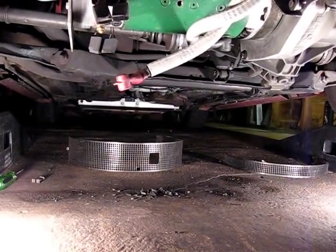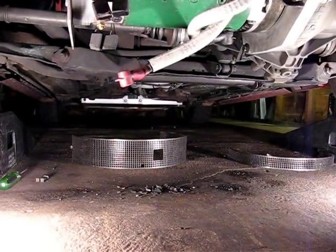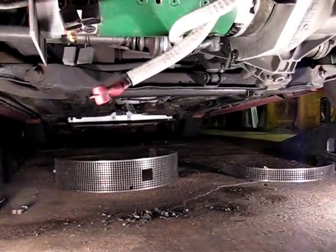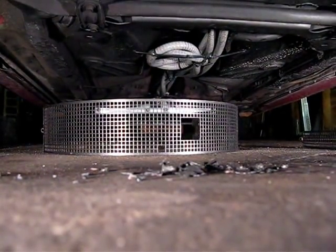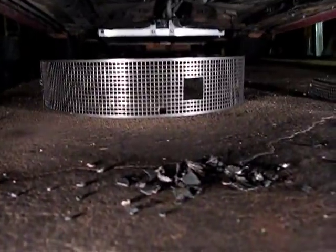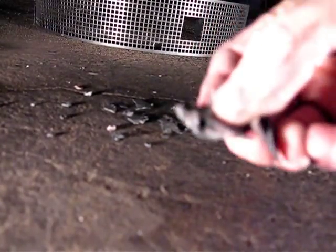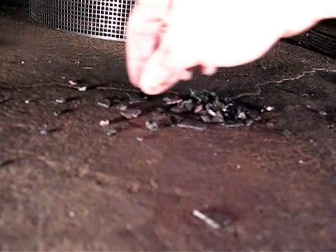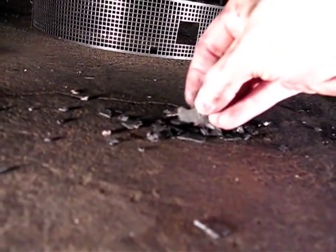Well, okay then. As you can see, we have the metal guards taken off of the motor, and there's a huge pile of debris on the floor. I swept this right before taking off the guards, so this pile of stuff all came out of the motor. As far as I can tell, these are chunks of brush that have melted and sheared off and just destroyed.